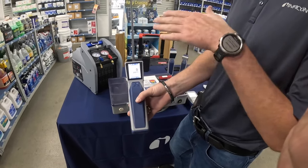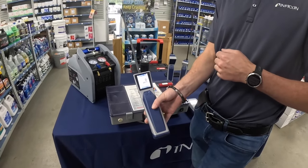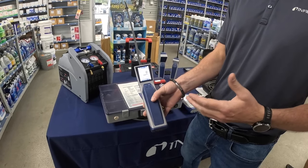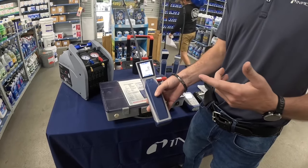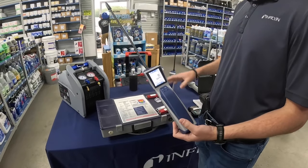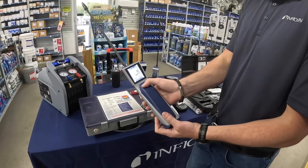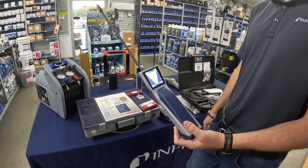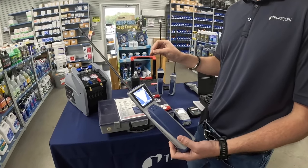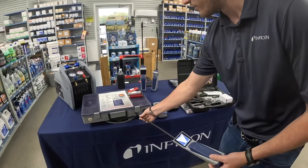All the time I used it, I didn't know it did that. Yes — the zero sensor button in cloud hunting mode just gives you a maximum reading. There is a different mode called manual mode I'll get into in a second. So once you've gone through and leak-checked everything, found the area with your highest PPM concentration, you can switch to pinpoint mode. This is what you use to get down and actually find exactly where your leak is.